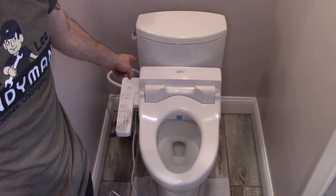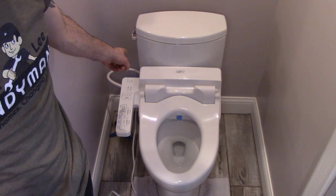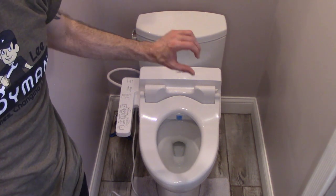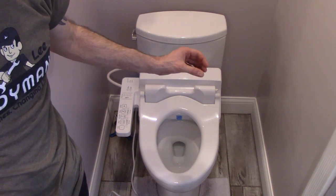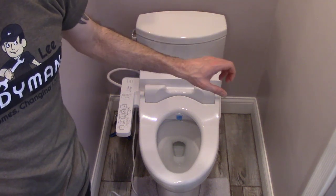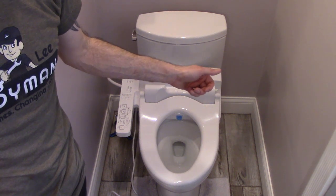A couple tips that I learned from Steve Lav, another real popular YouTube plumber, is that when I did the water, I cranked it in slowly and let it fill slowly. If I see a leak, then I can turn it right back off. But since there's no leaks, I just went ahead and undid it all the way out.